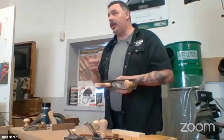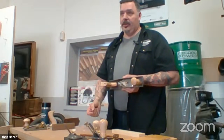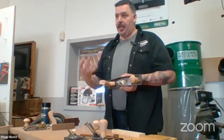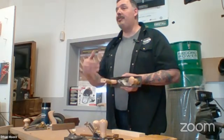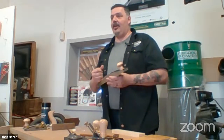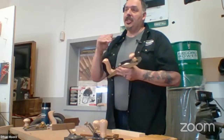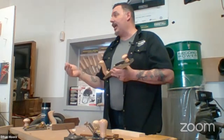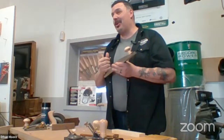With the exception of curly varieties — curly maple, bird's eye maple, woods that are notoriously prone to tear-out — you can swap in the 50-degree blade. Now the 50-degree blade plus the 12-degree bed puts you at 62 degrees. You're heading to the moon at that point. At 62 degrees, because of such a high angle, it's acting more like a scraper than a blade, and the scraper doesn't really care what direction the grain is going in.